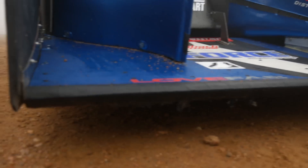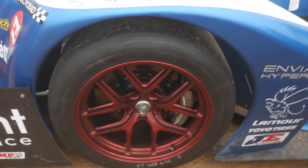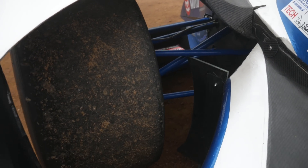How many kilograms of downforce is this making and what ride height are you running? At the average Pikes Peak speed of about 150 kilometers per hour, we'll have around 660 kilograms of downforce. If you extrapolate that to 300 kilometers per hour, that translates to 2,800 kilograms of downforce — which is more than what current LMP1 and Formula One cars produce. In terms of static ride height, we're running about 70 millimeters front ride height and 90 millimeters rear ride height.